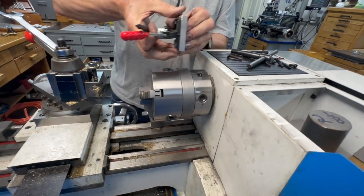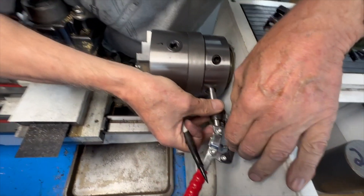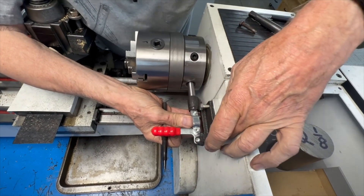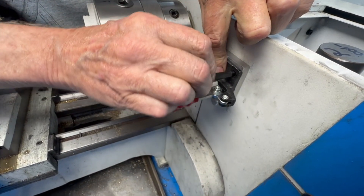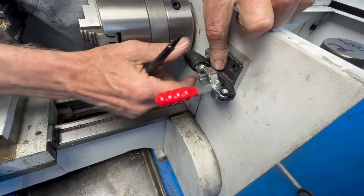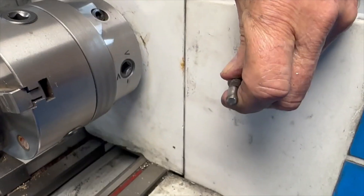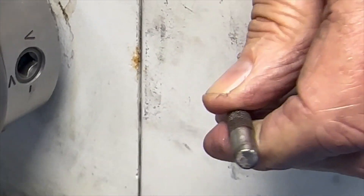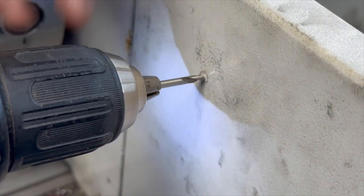The normal method: get it in position — I have three bolts in it and I just took one out. I'm going to put this in the engaged position, get it eyeball level, and then mark this hole and drill it. I'm doing this by eye, dead center hopefully. I'll mark that hole with the center drill.